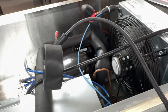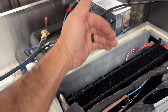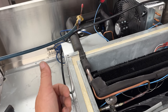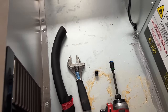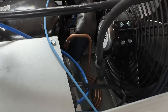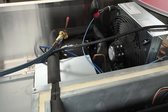Now it's working. I've always been very skeptical of nitrogen — I always feel like the nitrogen pushes the refrigerant around and then you have just a pocket there of nitrogen. Theoretically it should be static pressure and just push out. When I was blowing the R290 charge, you're looking at it coming out just clear, and then all of a sudden you start seeing the wigglies inside the light. Did not pick up anything on that. Just dumped in probably a few ounces of 404A and then put nitrogen behind it — still aren't finding it. I'm pretty well done with this place. We've got 250 PSI — that's where they told us to put it. I've scanned all down in this area, both sides of the coil, top, bottom, all the solder joints, down in that little well that always tends to leak, done the condenser — I'm done. I'm going to solder on a new tap and recharge this thing back to spec and call it a day. This has been the biggest waste of time.